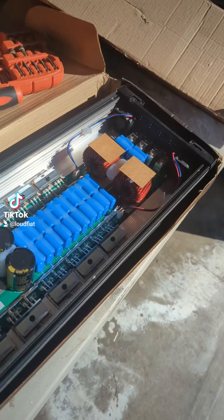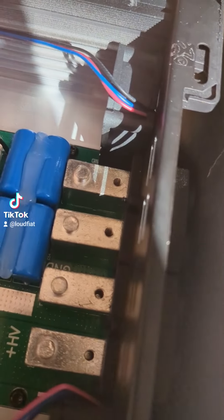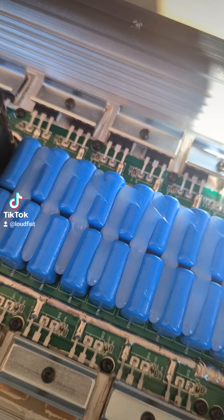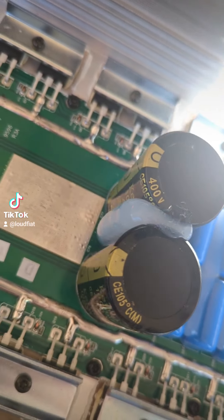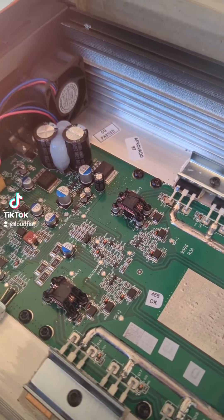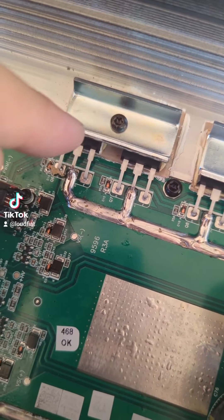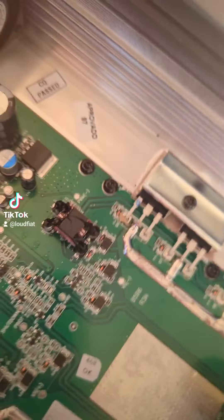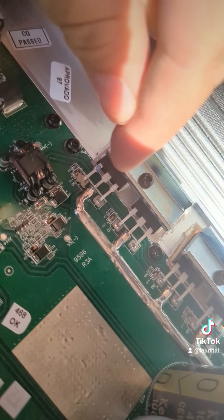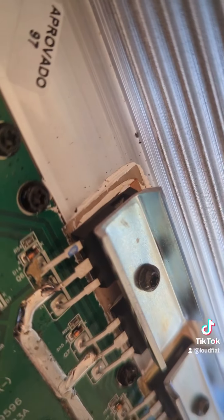Here's the internal of the Force Extreme — again, up to 440 volts and up to 195,000 watts. We can see the components are 400-volt components, just like the Force One that I'm using. And we can see just how massive these IGBTs are — 400-volt IGBTs. You can see them compared to my finger; these things are just freaking massive.